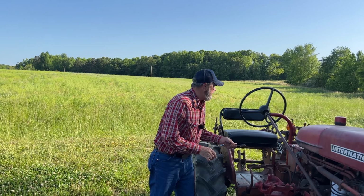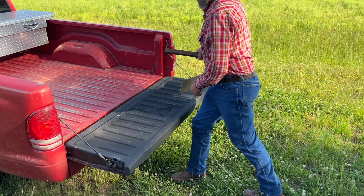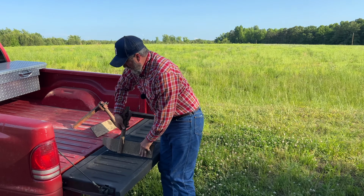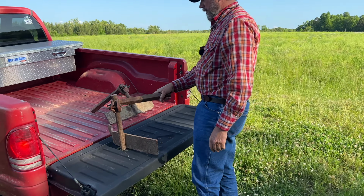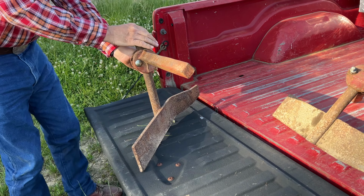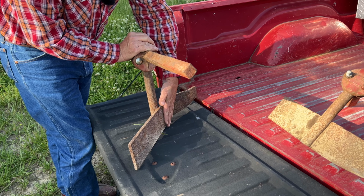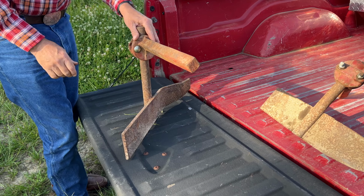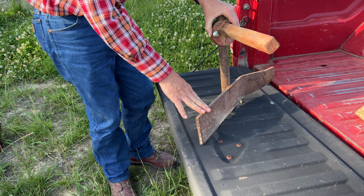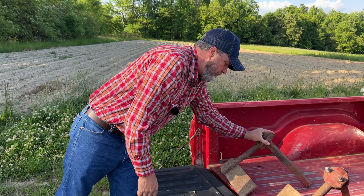I really enjoy this wrench for putting those things on and off. All right, so it was a thought. Unless I had a whole lot stiffer arms on this tractor, I don't see it working. And here you go, Will, why it's on the bed. So my thought was, guys, this one was going to be on the right side of the tractor, just like that, and you'd let it down and that dirt would have hit right here, and it basically just scrapes it off. Now on the Lilliston two row bedder, there's a set of rollers right behind this. So these would be running in a set of rollers right here, and those rollers would be putting it right back in the bed.